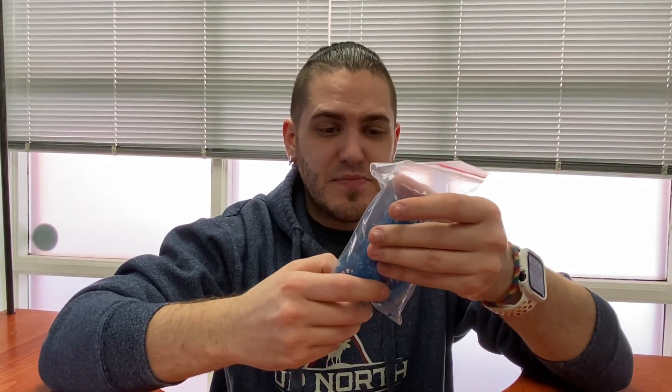That's not something I often say — that the profile was too good, dial it back. Oh God. I also did test prints at 0.025mm and they were phenomenal as well. At 0.05mm I can't see the layer lines except on the tops of curves where you can see the stepping, but even then it's very manageable. At 0.025mm it's just perfect. Overall, printing with Apply Labs Castable Cyan is a joy — I love this resin for the printing.